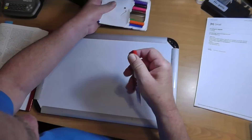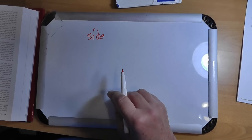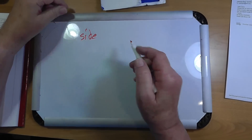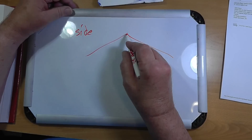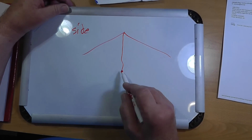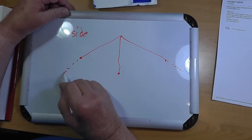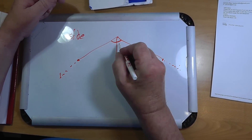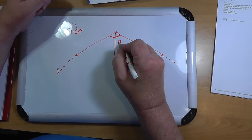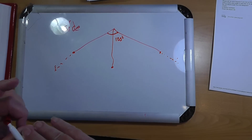Let's draw what he's talking about. Now let's look at it from the side. You've got an inverted V like this with one pole. The ends are usually kept in the air by adding rope down to the ground, and you've got to mark these so people don't trip over it, of course. The angle in here should be at least 90 degrees — 120 degrees from there to there is considered a good angle.